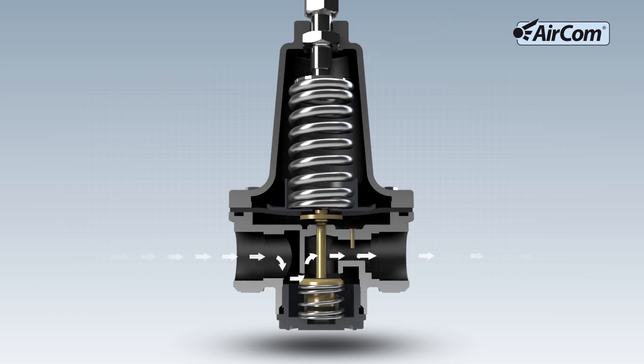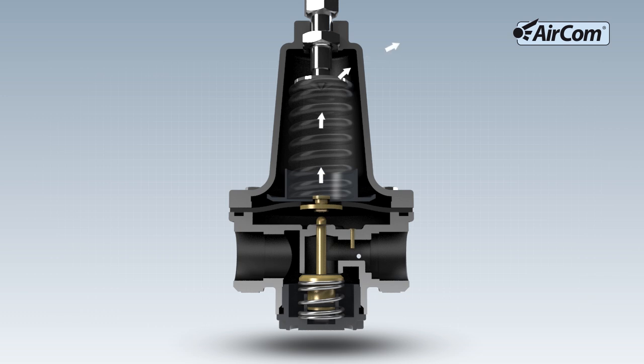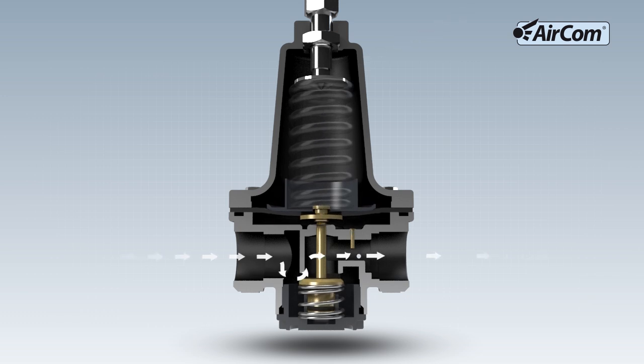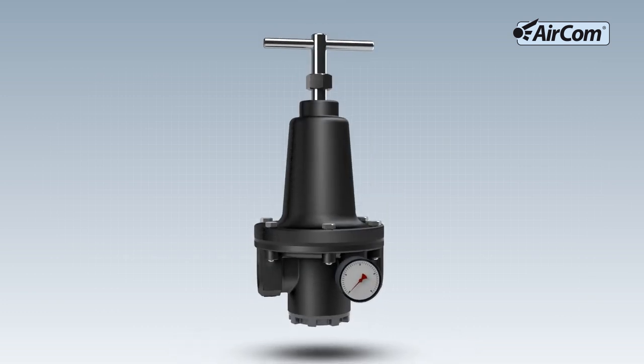This is not desired, however, for technical or toxic gases. A diaphragm without a venting valve is used for that. Excessive air or gas does not escape through the regulator. This function is known as non-relieving.